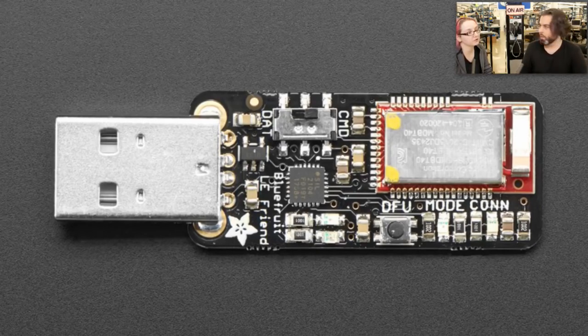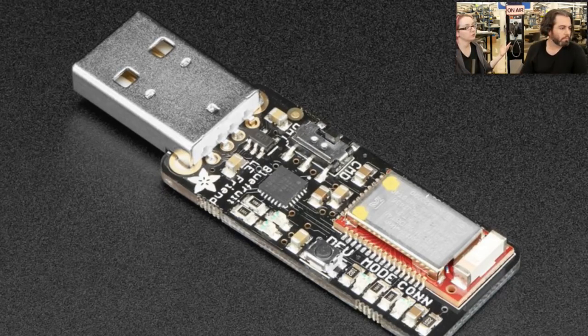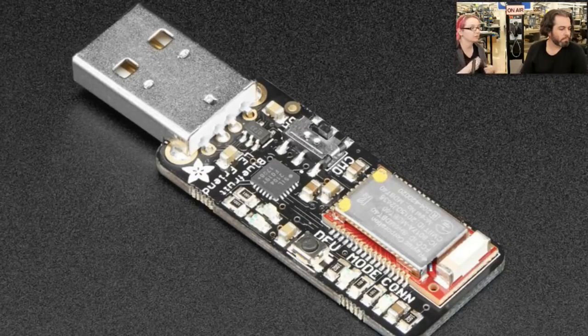And we also have a version that has our Bluetooth Friend firmware. What that's useful for is if you want to communicate with a tablet or a phone that has Bluetooth, and you want to act as a client device. Again, really useful for development if you want a custom interface, or you want to make sure your connectivity is working, or you just want to send data to and from a tablet to your computer. Even though some computers have Bluetooth in them, Windows 7 doesn't have native support, and even Linux, which does have some support, is a real pain to get working. This tool will let you basically use USB to serial instead of having to use BlueZ or OS X.